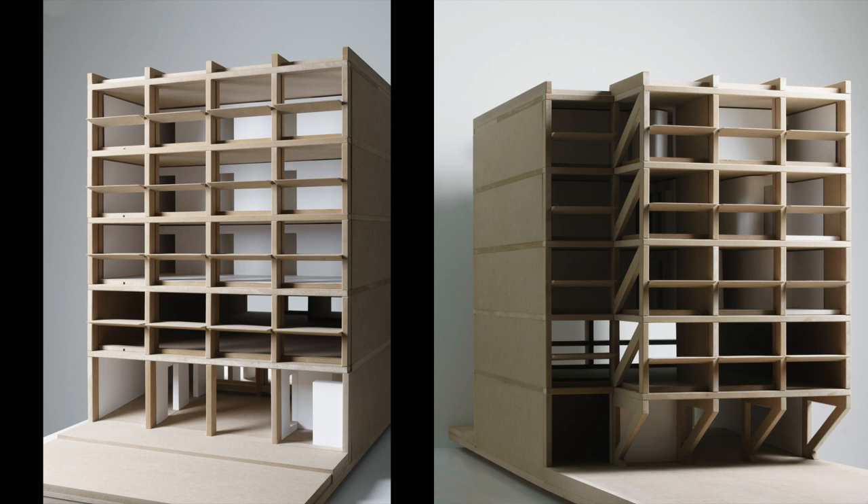This is something we can do because we live in a southern country and we don't have very strict thermal regulations. Usually when you see precast concrete in facades there's always the real structure behind it, but in this case it's all outside. We have only the staircase, the elevator as structural elements, and one pillar in the middle — so it's the two facades, the shaft, and one pillar working together.